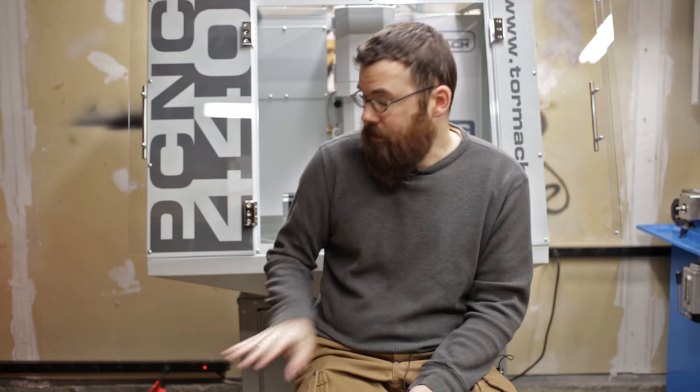This concludes the unboxing and initial setup for the Tormach 440. Hopefully that gives you a better idea of what's involved in getting this set up. I filmed this over several days and the filming takes longer than just doing the work alone. Someone could get this done in a weekend by themselves, possibly sooner with help. It took me about three days with filming, but I was also learning everything from scratch. A couple of tips: get some half-13 leveling feet for the stand and have some extra 10-32 screws and nuts on hand. For the enclosure, it just takes a little time but goes as expected. For hoisting the mill, definitely have an engine hoist, and make sure you get a clevis because no standard hook is going to fit into that tiny little hole.